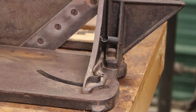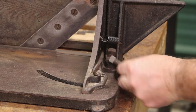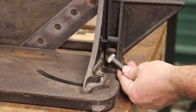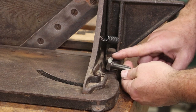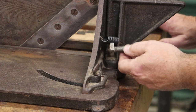This is a special bolt — a square head bolt — but the problem is the head size is really kind of a non-standard head size. It's five-eighths across the flats, and you can see this is a regular set screw that really doesn't have much of a shoulder. That one's only a half inch across the flats, and here's a regular square head bolt that's three-quarters of an inch across the flats — and three-quarters is too big, it won't fit in there. So the game plan is we're going to mill the sides of these flats off and get them down to five-eighths inches across the flats.